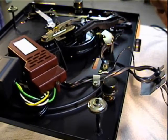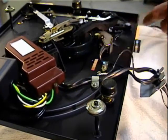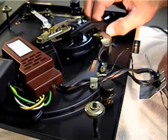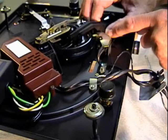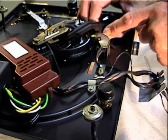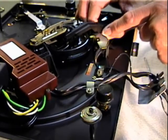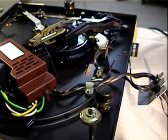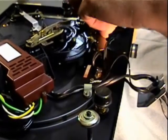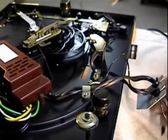And the older turntables have an axle which goes straight through here and is held in place by two C-clips, and if it has something like that, you want to pry off the C-clips with a jeweler's screwdriver. Removing one will do the trick, and catch it with your thumb or finger to keep it from flying away or into your eye. If you lose it, you may not find it because it's pretty small. So that's how the main lever comes off, and I'm going to pry this one off now, and that reveals where the Steuerpimpel will go, which is right on this pin right here.